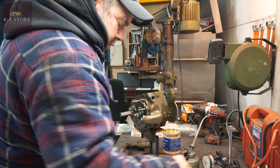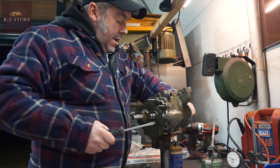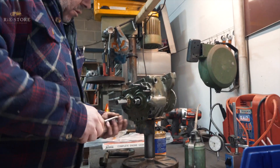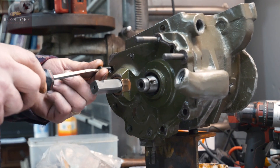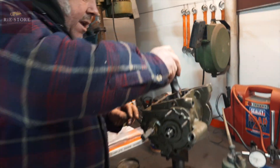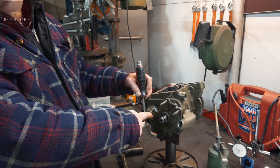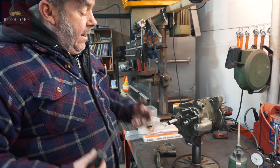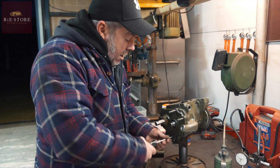Okay, five screws, two studs. When you're pre-assembling all this lot, you haven't got any location springs in there or anything like that, so it all ends up nice and loose and you can shim it all up nicely. Draw the casing in evenly — that's tightening up now on that rubber, but as soon as it spins up it'll just free itself up. If you look at where your gearbox oil level is, it's right down here — so realistically that rubber is pretty much a fail safe. I have known people build them without them, but I tend to try and get them in, because it's literally only a bit of rubber and it will break itself down to where it doesn't matter — it's got enough in there to seal it.